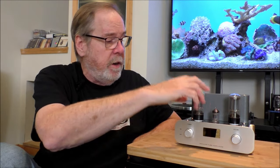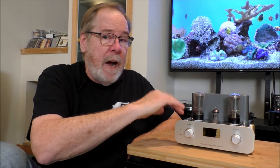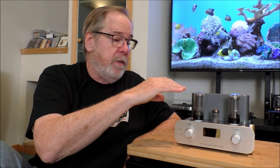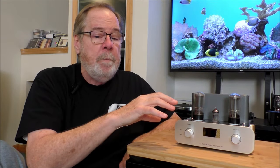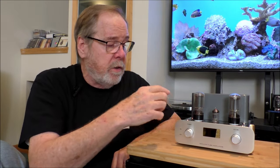The way it works is it uses a 6N1 — actually a 6N1J — for voltage preamplification, and 6L6s for the output amplification. This is a dual triode design, so it has two triode sections in one tube, allowing it to do stereo. It adds flexibility for the designers to use one section for gain and the other for phase splitting. The 6L6s are typically used in single-ended pure class A, and this is a pure class A amplifier, which provides large driving current even at low power.